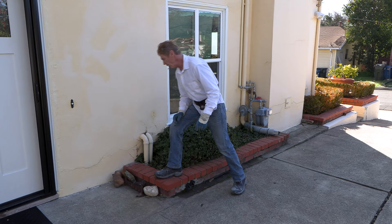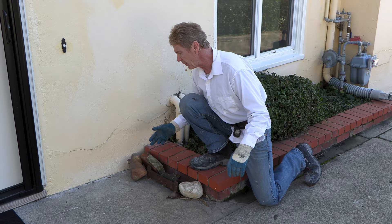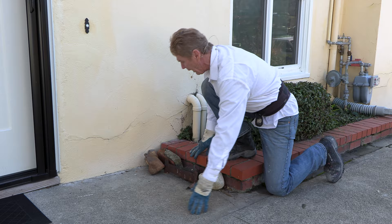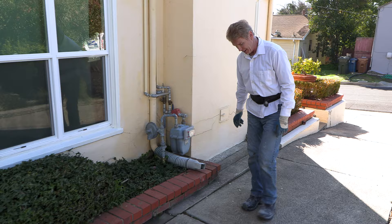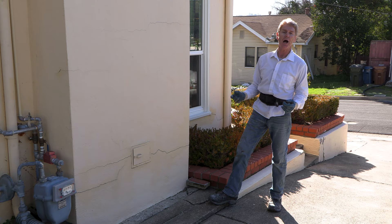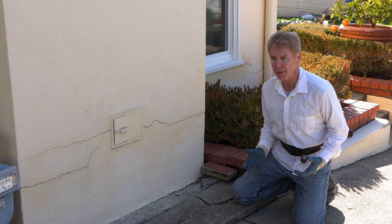So we're just next door. This house is about 130 years old. Now you see this crack — and we had five weeks of rain, the most rain we've had in 30 or 40 years in one single month. This is what I call double locked in: the stucco goes to the foundation, and they butted concrete right next to it without a piece of wood in between. You should put a piece of wood in there — whether it's polyurethane or whatever — to create an expansion joint. Somebody might say, wow, that's beat up — but that's not beat up, guys. This is a brick chimney, a brick fireplace, and on a scale of one to ten, I'd rate this a nine. This building has integrity. You judge this by five weeks of solid rain — 52 inches, something crazy.